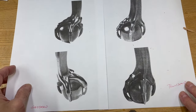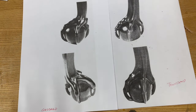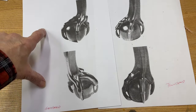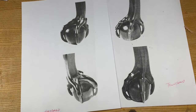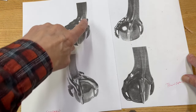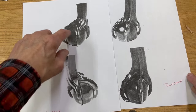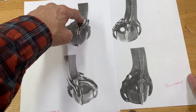Here are some pictures of ball and claw feet off of actual card tables — not all the same card table I'm working on, but similar. These two are Townsend's — John Townsend — and these are John Goddard's. On the back toe, see how John Townsend's are just straight, but you've got a little bulbous thing on the back there. And the other difference is this goes back farther — where the leg comes down, it's farther back on the ball.